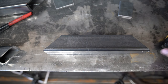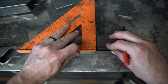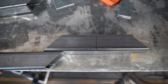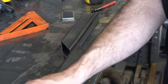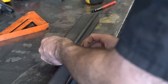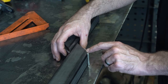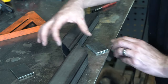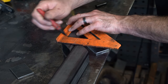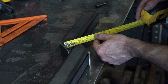To start, I need to find the center of my middle piece, which is 11 inches wide — that's five and a half inches. I'm going to draw a line to mark the center, and this is going to be the absolute center of the cross member. I'll bring in one of the pieces already cut at a 45 degree angle — I just haven't made it the right length yet. The plan is to create an illusion where the pipe comes in horizontal, curves up at a 45, and then back to horizontal again, by welding in this seam and adding plates onto the side. The key is that the width at the joint needs to match the width of the pipe, which is two inches. Since I'm adding quarter inch plates on either side, that's a half inch of material, so the distance between the cuts needs to be an inch and a half. Once set, I'll draw a line across both pieces to help line them up again without measuring. With the quarter inch plates added on the sides, the total distance is two inches, which matches the pipe.